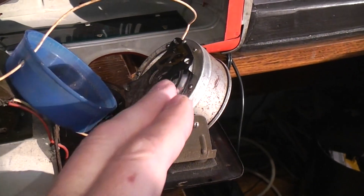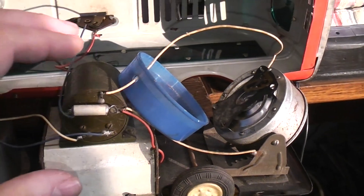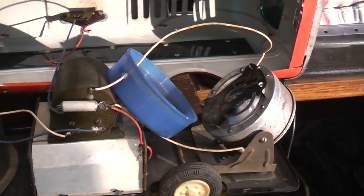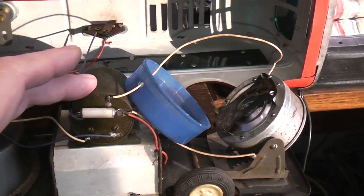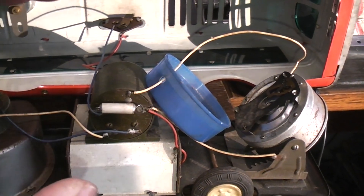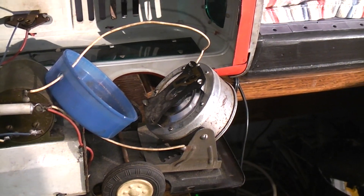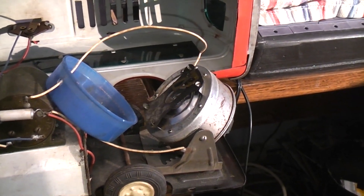When the diaphragm is not vibrating, this relay will normally be in the closed position. It's a super sensitive double pole double throw relay, and when it does vibrate, at some point there won't be enough voltage for the relay to stay closed and it'll open. So the relay not only acts as the switching device for reversing the motor, but it's also a threshold detector — a comparator, if you will. It will reach a point where it won't stay latched and opens, giving you a clean comparator with hysteresis built in. No transistors, no ICs, no tubes — it's all electromechanical, and it detects a specific tone and doesn't get activated by just any sound.